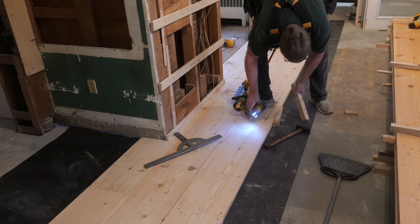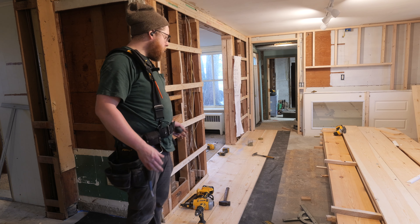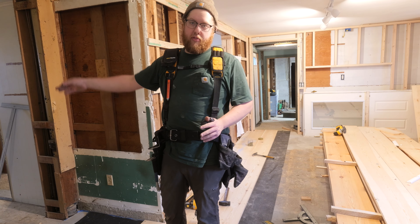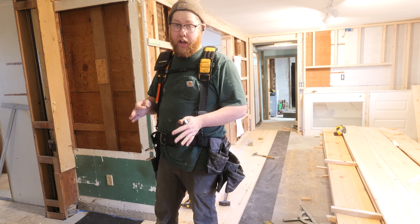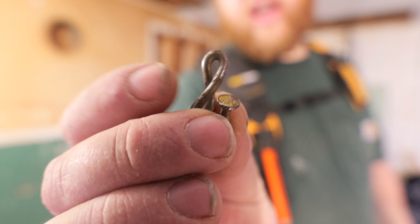It only took me three years but I got three rows down — not too bad. I can always move the boards over if I have to. I'm thinking I'm going to move into the pantry. There's a ton of floor leveler over there. The floor leveler really does not like to be nailed — here's a section where I put a nail through it and it curved on its own. Where I nailed when the stuff was fresh it went right through like butter, but now that it's fully cured that's not the case.